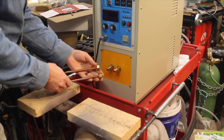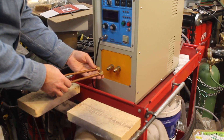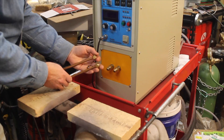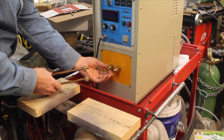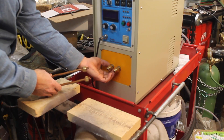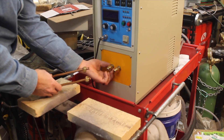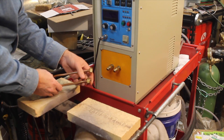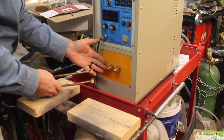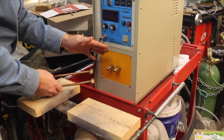Coils are made from copper tubing and attached to the front panel of the LH-15A with two 8mm flare nuts. My unit also came with two extra fittings to screw onto the ones that are attached to the front panel, so that these can take the wear and tear of putting on and removing coils. When they wear out, I can unscrew them and replace them easily.